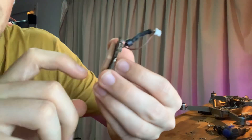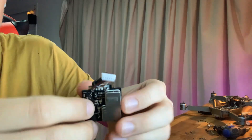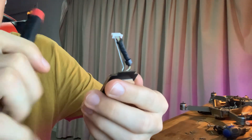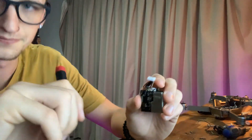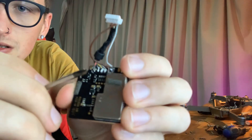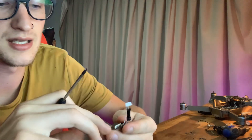Instead of just throwing your GPS unit out — even though they're only about $50 to $60 Australian dollars — that's $50 to $60 you can save. If you have the same issue and it's not locating anything, just have a look at these wires. Pull the silicone back a bit and you can see the wires better. I also tried updating the firmware and downgrading to the next version down — some people said a firmware issue could fix it — but that didn't work either. So just have a look at the wires and see if anything is burnt out. Give it a smell like I was saying; it doesn't smell burnt anymore, so it was just that wire.